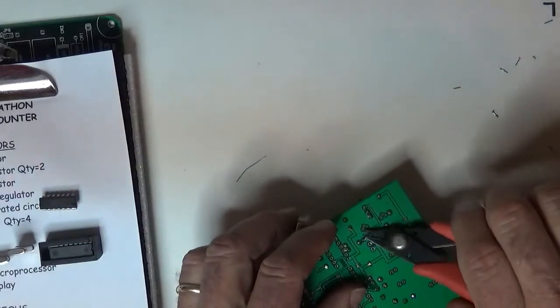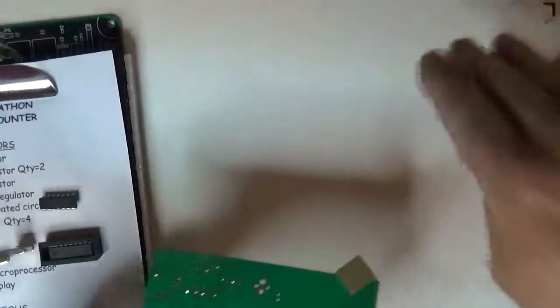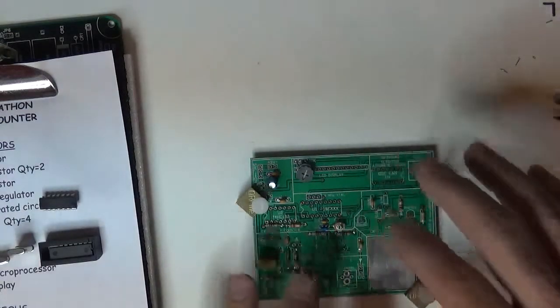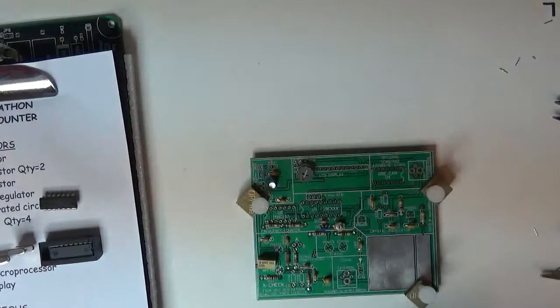There's one that's a little high right there. Okay, got all the resistors, all the capacitors. I suppose, I don't know, pick one. I guess we'll do some... In the back of my head, I'm doing all the stuff that's kind of low to the board, and as I run out of things that are low to the board, I start building up.